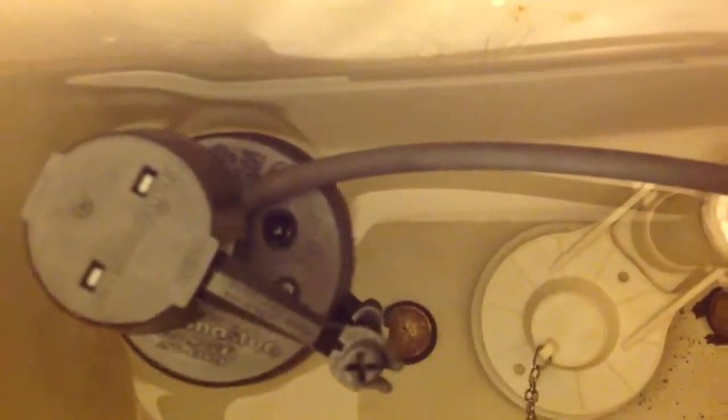On this commode, I want to show you — I believe this is a replacement valve. It's adjusted with a Phillips head screw right there. That's how you adjust the float. These are common; it's probably mostly what you'll see — it's a replacement valve. One thing I want to warn you about with replacements is they are adjustable. You can adjust them higher and lower, so make sure you read the directions on how to do that. A lot of people make the mistake of just putting it in right out of the box without reading directions. Find out how to adjust it up and down, and it'll tell you how high you should set it. This is basically a standard setup — it's a long tube flapper with a replacement fill valve in it.